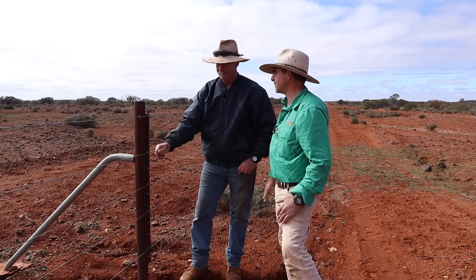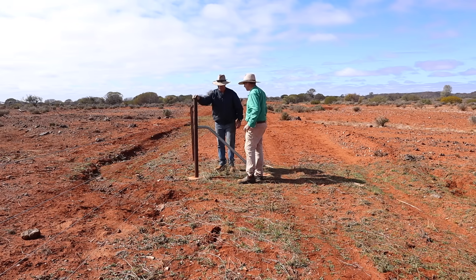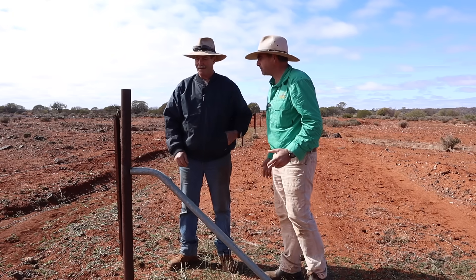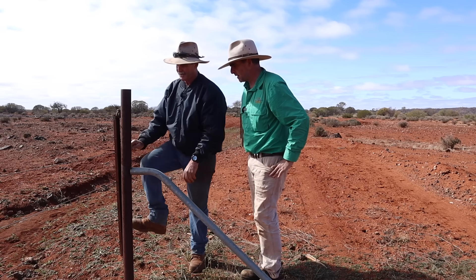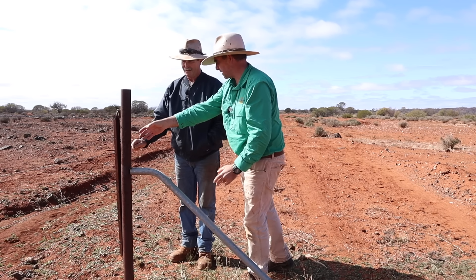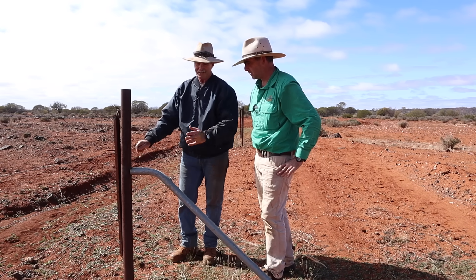This is the first post in the floodgate proper. Water is flowing from left to right. People are going to say the strut is on the wrong side — the reason is that we've got a star picket suspended by the top only, those two chain links, so it has to hinge up. If the strut were on the other side, it would restrict the fence hinging up. So it's a compromise — ideally it should be on the downstream side, but it's going to interfere with your floodgate. It's not ideal, but we increase the post strength with it on this side.